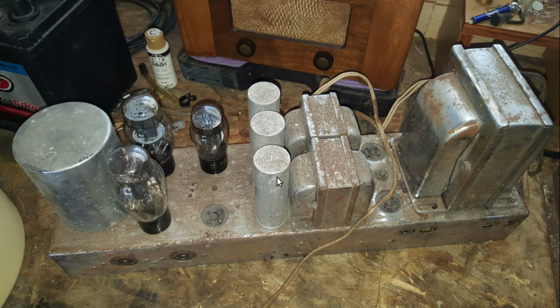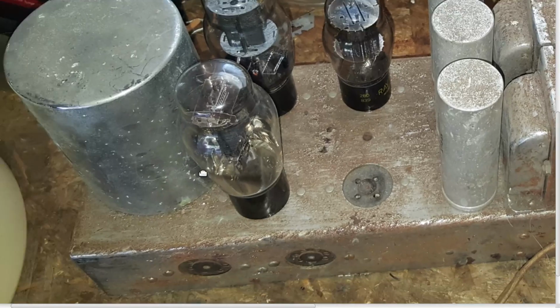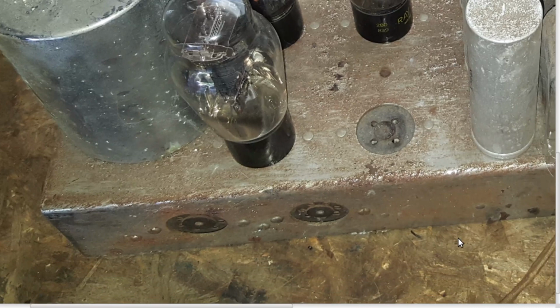And here is the power supply / output PA chassis. Just from looking at it and having a moment to think about it, I pretty much figured out what they're doing here. So these 4 tubes are all identical, and these 2 are the power supply tubes. These 4 are the audio drivers and a push-pull audio output stage. So let's zoom in and look at the condition of the chassis, because that's the condition of the chrome, because that's what this video is all about.